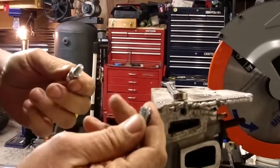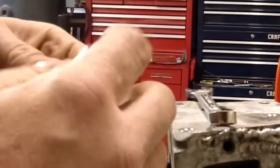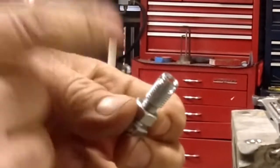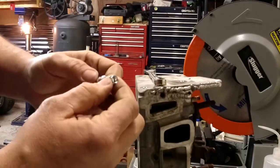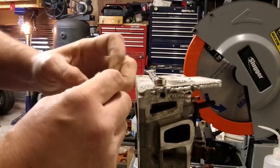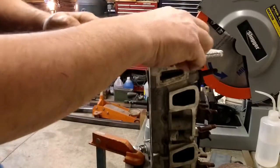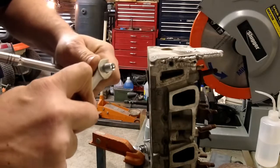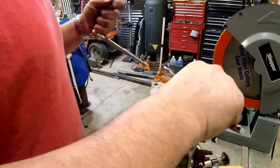When you thread the insert onto a standard bolt, make sure that the little holes aren't covered up, because that's what's going to do the tapping when it's screwed in. When you screw the bolt in, make it just shy of those holes, and then bring the jam nut in. You're probably going to have to get it started a little bit, just to make sure it's good and tight. Tighten up on it, and now we're just going to drive it in.